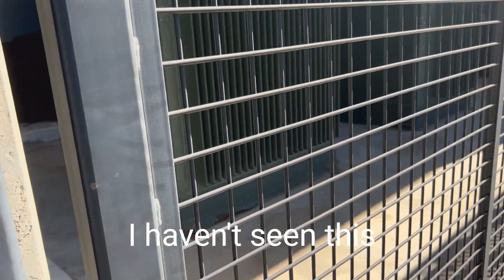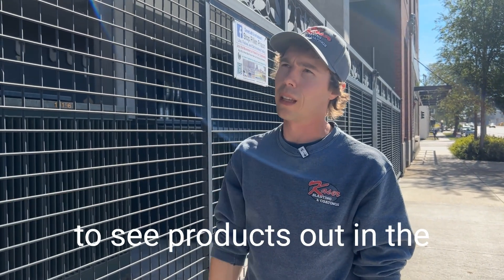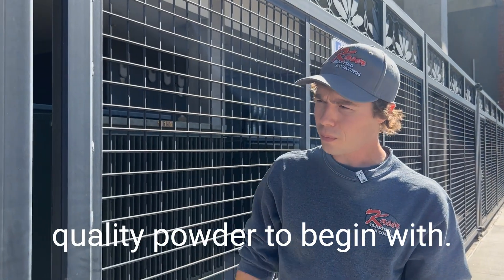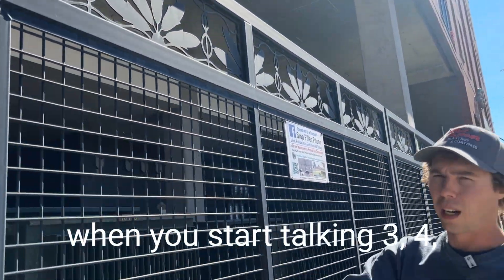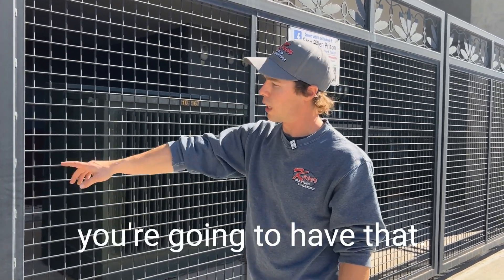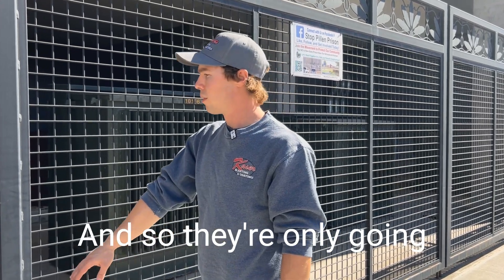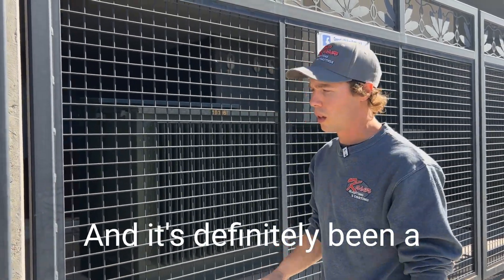I haven't seen this powder fade very much, mainly because I don't get to see products out in the field that we coated several years ago. A way to avoid that and to make it hold up better would just be a better quality powder to begin with. This is a pretty decent outside durable powder, but when you start talking three, four, five years, unless you have a specially formulated super durable powder coating, you're going to have that. Most powders that are cheapest and most readily available are regular durable, and they're only rated to hold up for one year color and gloss — and it's definitely been a lot more than one year.